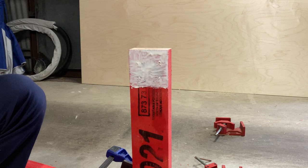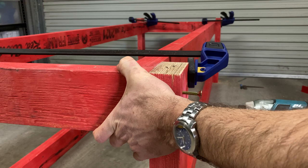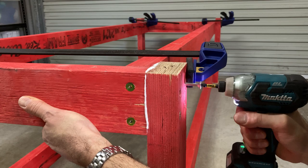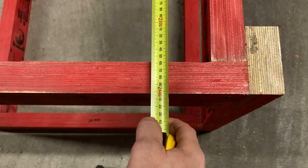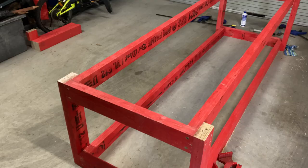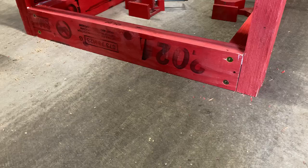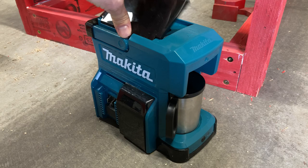Joining the top to the bottom required a bit of mucking around, but once I had it set up I was able to align the corners and glue and screw. What's so interesting about the LVL beams is they're relatively light to handle, yet very strong, and most importantly, straight. This makes building rectangular frames like this so much easier. A quick length check - 2400 long and 780 wide. Perfect. And there you have it - most of the frame done. Time for a coffee.